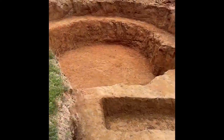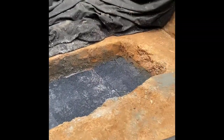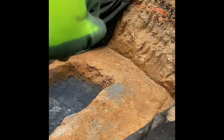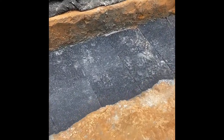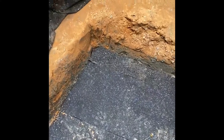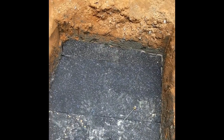We're putting some floating stone steps across the shallow end of the pond, and I just want to show you how we're going to prep for that under the liner. What we have here is a footer for the floating steps — they're going to come across the shallow end from this side to that side. Under the liner, we poured a 12-inch footer of steel-reinforced concrete to support underneath the liner so we don't have any settlement.